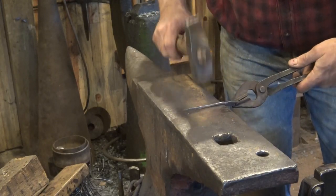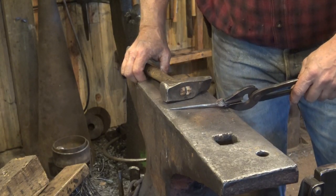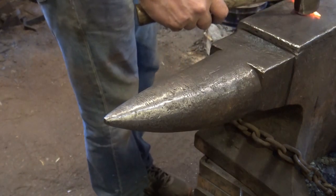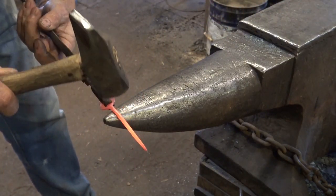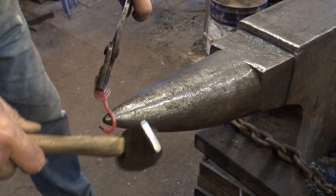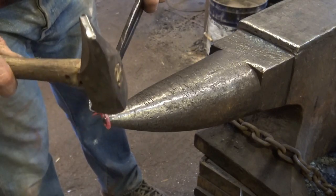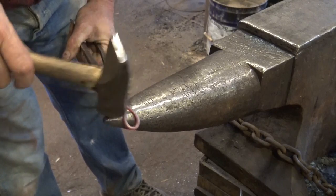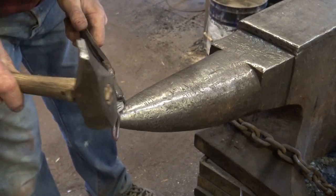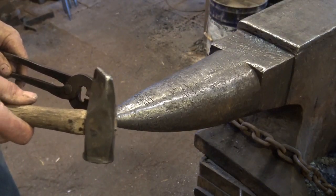You want this to have a certain organic look to it, so you want to take all the ridge lines from being square or octagon out. This isn't chamfering — it's definitely rounding, although the occasional flat spot isn't going to hurt anything. It's probably about three to four inches long. Now we want to just give that a graceful bend — exactly what you do here is purely up to what you feel like doing. I want to bend that tail off just a little bit, and when I get it wrapped around I want to bring it to the front, just set it down across the front very lightly — that's just to kind of seal it up so it doesn't fall off whatever you put it on.